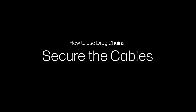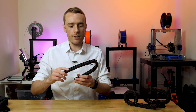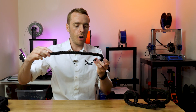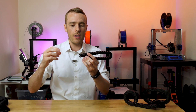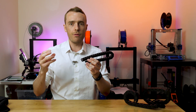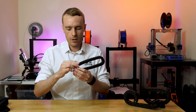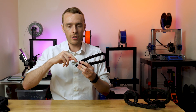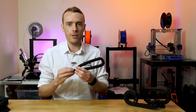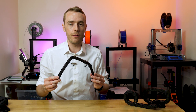Next, you want to make sure that you clamp the cables at both ends, typically with something like a cable tie. During motion, as it moves back and forwards, you get a caterpillar effect where, although there's no overall motion in the cable, the wires on the inside tend to slip slowly at one end. If they're not controlled, this can cause excessive wear on the cables in the bend. Just off each end of the drag chain, somewhere very close, the cables need to be permanently fixed — no slipping, sliding, or movement of any kind.